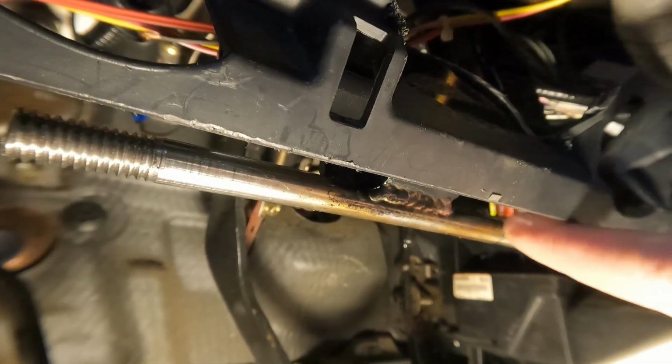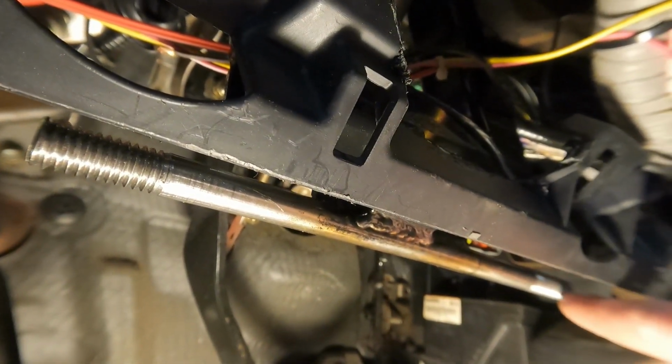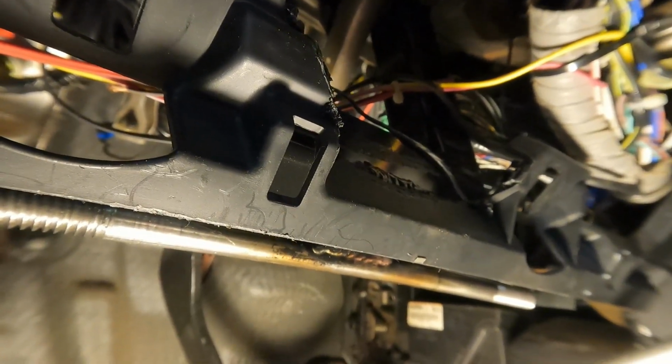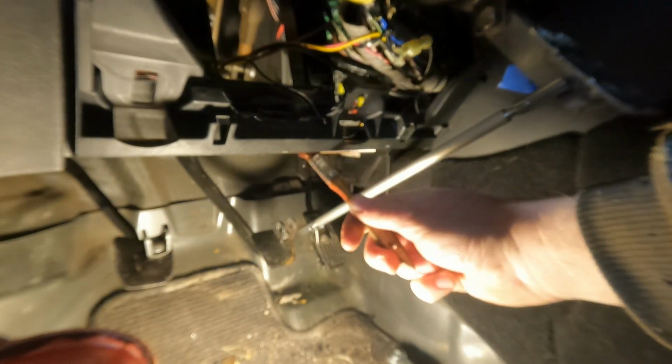I don't know if I can get underneath here. And then those bearing blocks will pivot on this rod here. You see I threaded it on both sides, so I can put a nylon lock nut on and adjust it up until I'm satisfied with the fit. Let's get the brake and put that in. Same thing, a little bit of grease on the pivot.